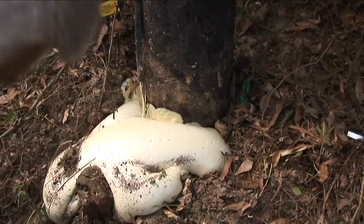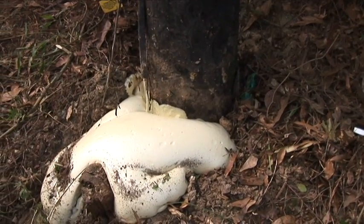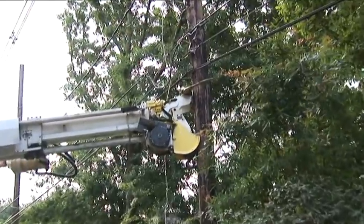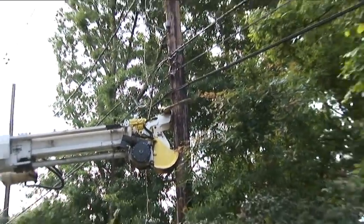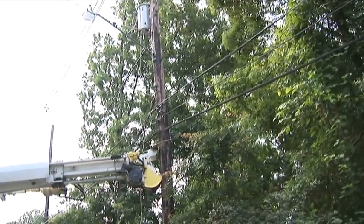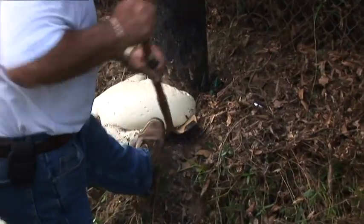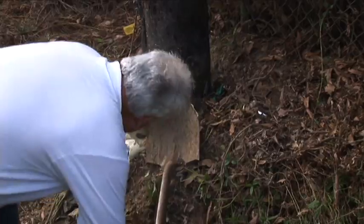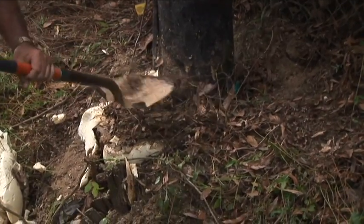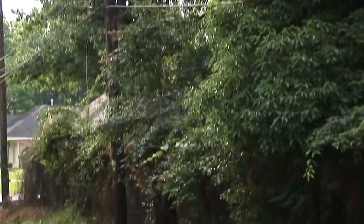After a period of approximately 15 to 20 minutes, the equipment is released from the pole and the facilities are reattached. Notice that the pole came back just a little bit — that is because there was an additional 8 to 10 inches of rake in the top of the pole. After 10 to 15 minutes, you can take a shovel and cut the excess foam away. Notice the seal around the pole. We simply dress the pole out, and as you see now, the pole is straight and the job is complete.